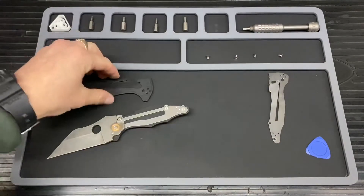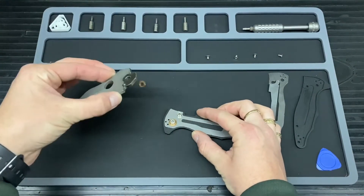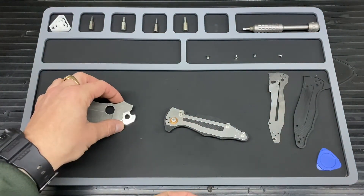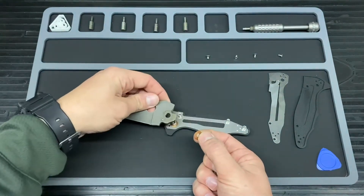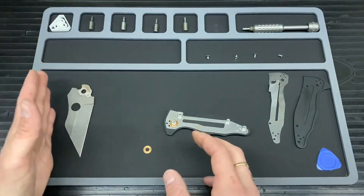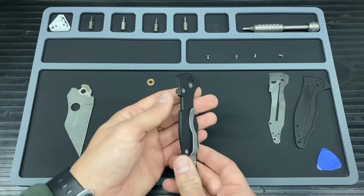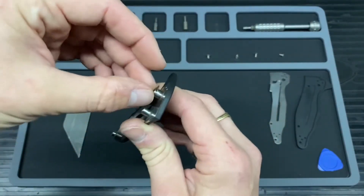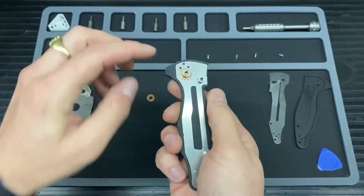Just keeping the parts over there out of the way. At this point you can pull off your blade — a washer comes with it. There's the blade and there's the phosphorus bronze washer for this side. To get the other washer out, it is actually held in — there's a little step there that holds the washer. I'll just show you. That's where the washer sits, sandwiched into place onto the inlay.